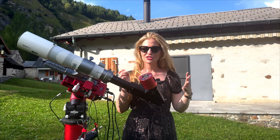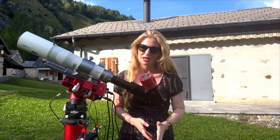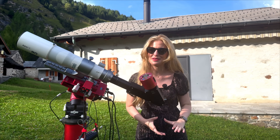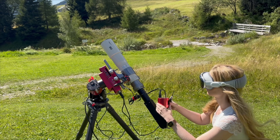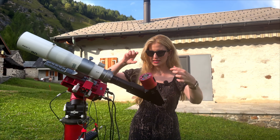You always start with the camera. For this first focus step, you don't even need the sun or the telescope. You can literally take the SHG, point it at the blue daytime sky, and you'll already have a spectrum — because the diffraction grating splits the diffused sunlight into a rainbow no matter what. You'll see all the absorption lines, and your goal is to get those lines sharp. There's a micrometric focuser built into the SHG for this and it's incredibly precise — very satisfying. You slowly dial it until those curved spectral lines look crisp and well-defined, and while you're doing that, you rotate the camera so that the lines sit horizontally across your sensor. Once both are correct, you lock it in.